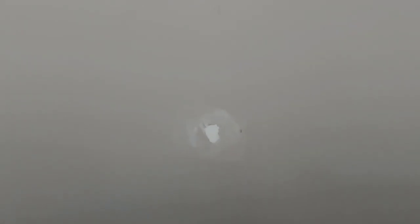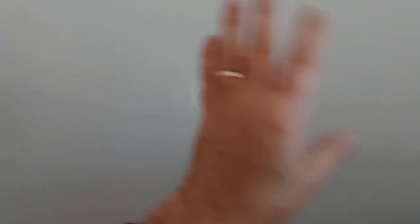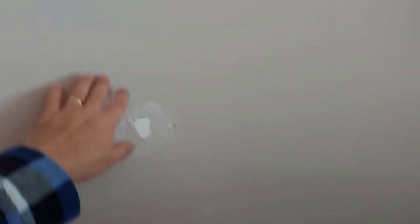That's going to be our first tip today — I'm going to show you how to prime these properly. I don't use a brush; I actually use a roller, because when you use a brush you can see the brush strokes even after you've painted, especially if the light hits it a certain way. Since these holes are near a window, that's when you start seeing your mistakes or blemishes in the walls when the light from the window shines in on them. So we're going to roll our primer on there so it's the same texture and hides any blemishes.